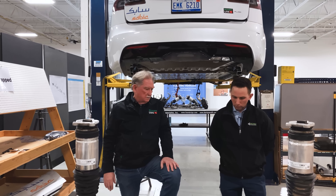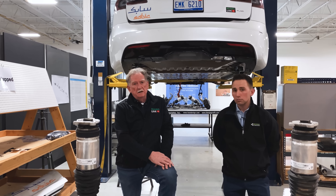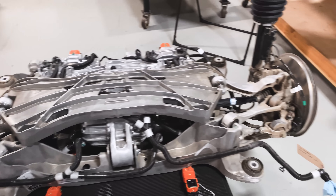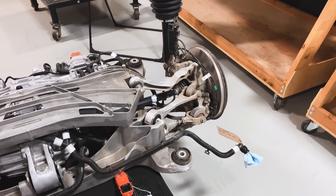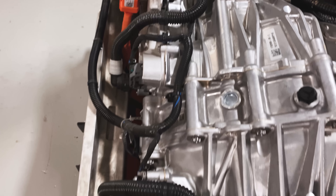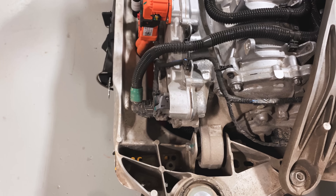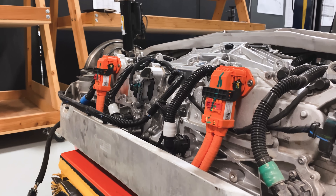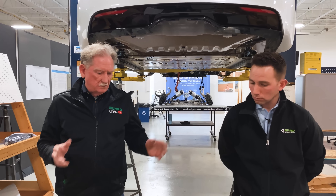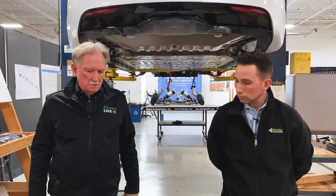This would basically be brought up in one fell swoop into the rear of the vehicle so that all the stuff could be attached. The other thing we were looking at was finishing up with the different grades of aluminum. Jordan's going to point out the different types — this isn't all the same material. It's aluminum, but it's like saying plastic. There's no such thing as plastic, and there's really no such thing as aluminum. You want to know what grade it is: some are 5000, some are 6000, some are 3000 series.